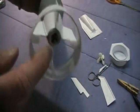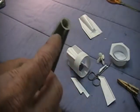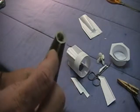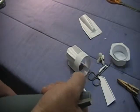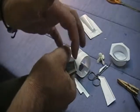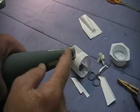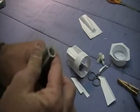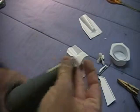You see the hole here — I thought it was a piece of wood but it wasn't. They had just poured epoxy or polyester resin down in there. This is hollow, so you have to be careful sanding that off. If you can cut it off with the Dremel tool that would be better. Just hold it tight if you're going to use a belt sander, or just cut it off with the Dremel tool. Once you cut that off, you'll need to go in there and put some CA to make sure this all stays together.